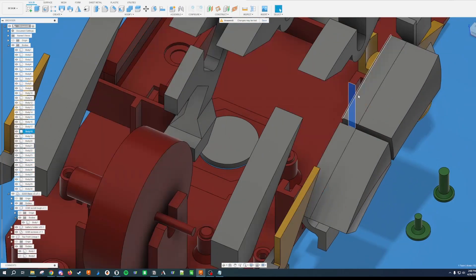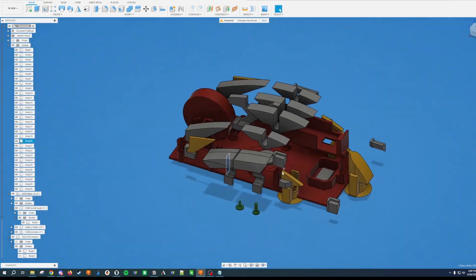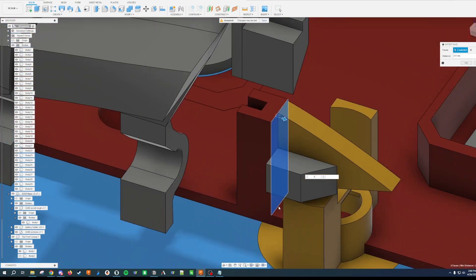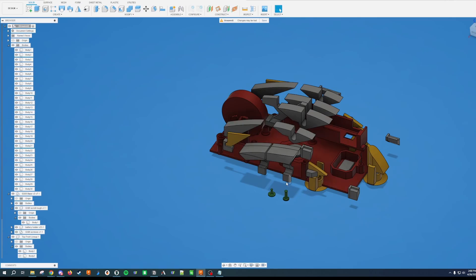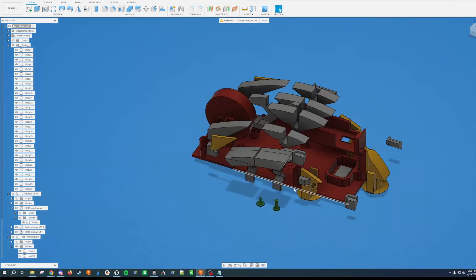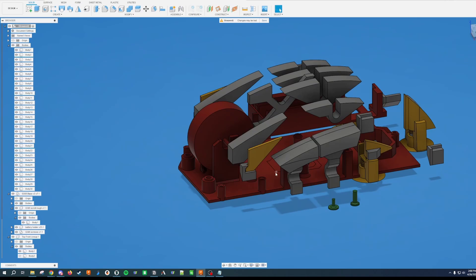These are the side button posts. They're very thin as is — I just use them for placeholders and then build more geometry around them. At minimum, you're going to want to take these and extend them by some amount — 0.2, 0.4, 0.6 — and then add chamfers or whatever. Build it out so it is more suitable geometry. It doesn't need to be so thick, but you probably want more support. They're mostly just a starting placeholder, essentially, which is what a lot of this is.